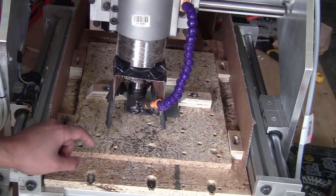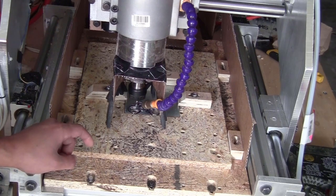I have to stop the cutting in the middle because, as you can see, the piece of steel and also the bit start to get hot and all the chips start to light up and fly around, and I think that the bit will break if I go any further. So to cut steel, I will need some type of mist coolant or fluid to spray to the bit.